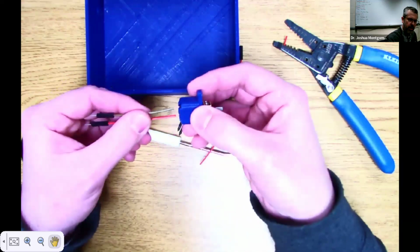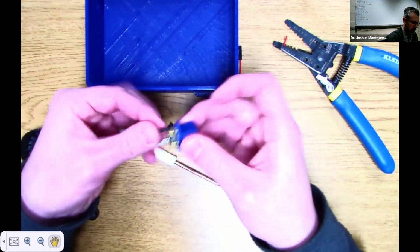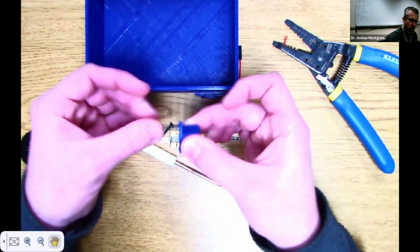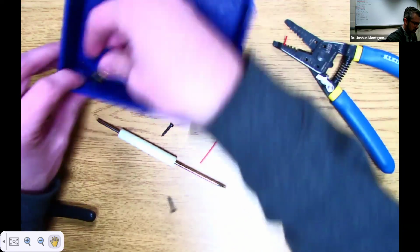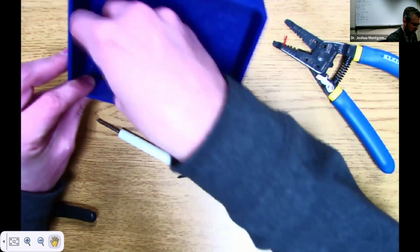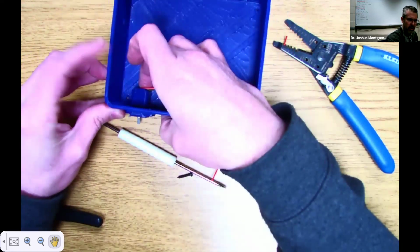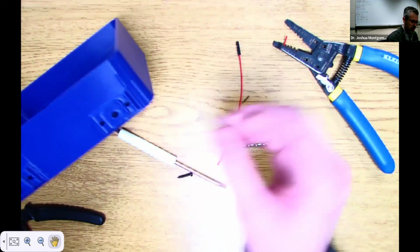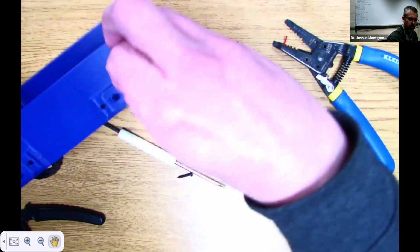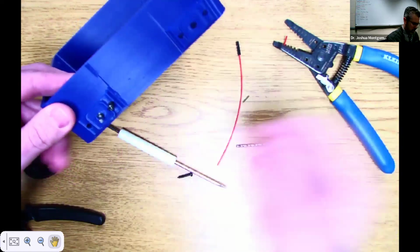We have the wire sticking out the back, just like this. You'll notice the screws that go in here are tight, like they're supposed to be tight, because this is what's going to hold and compress the motor to the base. So this will attach the back side, like so, just like that. And then we screw in here. Now you'll notice that the screws are really loose through that, which is the idea. We wanted that to be loose so that the tension we have is actually right here. So I'm going to go ahead and screw this in.